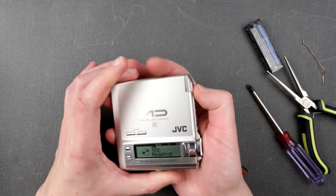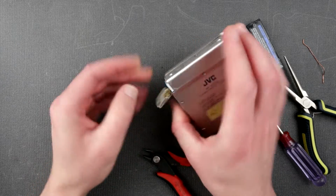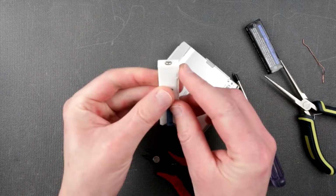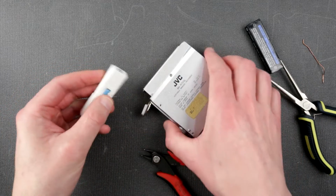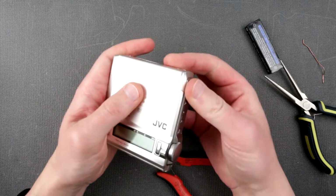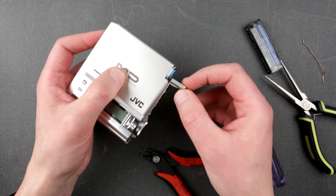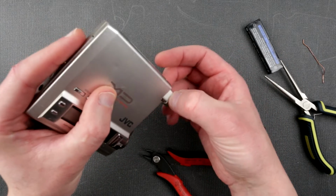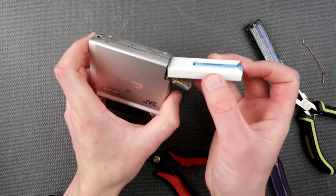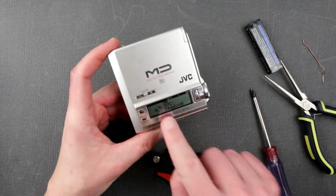If you're having issues opening this, like me, for example, in this case, you see it's sort of pushing it back. Go here, take your screwdriver, screw it a little bit more, more shallow here, right? You see that? Try it in. Okay, this is a little bit better. Still a little bit too tight, so you can still try to screw it more, but if you screw it too much, it's not going to be making any good contact. All right, maybe a little bit more. You can adjust it depending on your specific player and the springiness of your springs. All right, as you see, it's working.